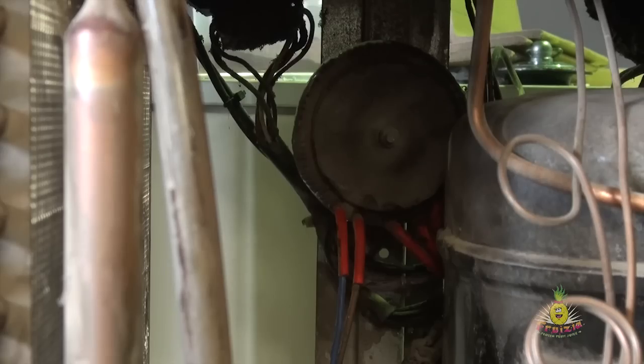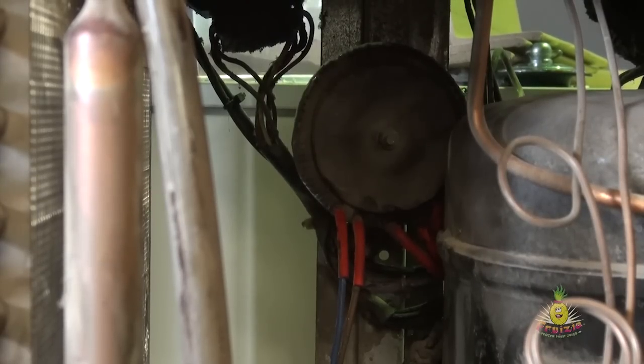Now, this is a cab gearbox whereby the gear has actually split, and you can hear it, the clicking, every single rotation of the gear. That gearbox will not be able to turn the product within possibly minutes or hours, and therefore that machine can't be used.